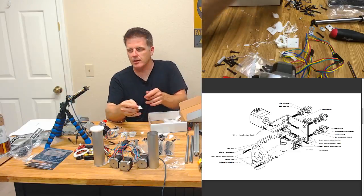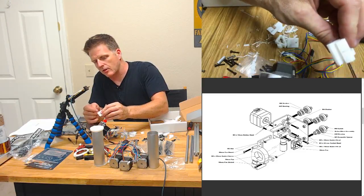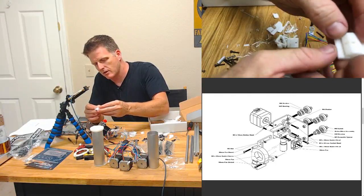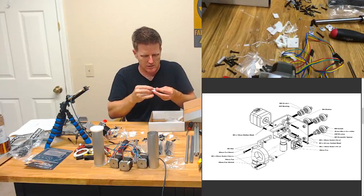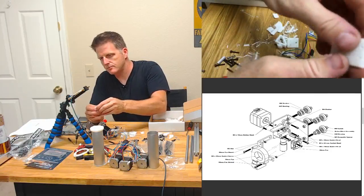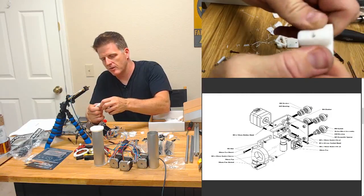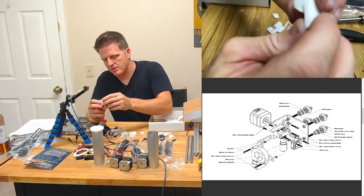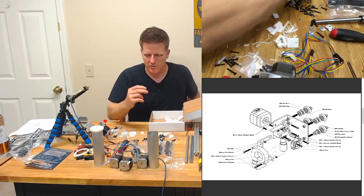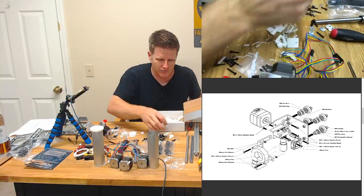It's always an interesting thing about printing ABS, you get these kind of scorches where it gets a little sloppy on the nozzle and it kind of toasts and burns, and then it gets on your model like that. You don't see that same effect with PLA. But I just love how solid ABS is. I haven't printed a lot of ABS in a while. You can get really strong parts out of PLA as well, but a nicely printed ABS part is a thing of beauty. Also, the layer lines don't show nearly as much, so I feel like it fuses together a little bit better.